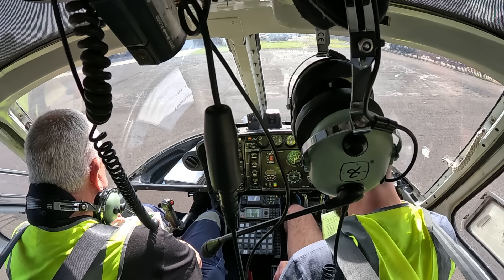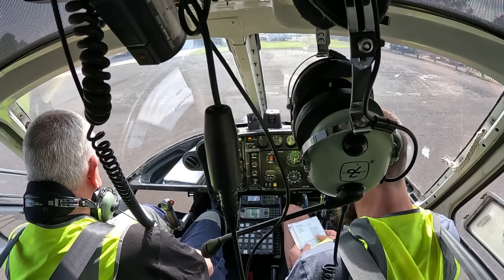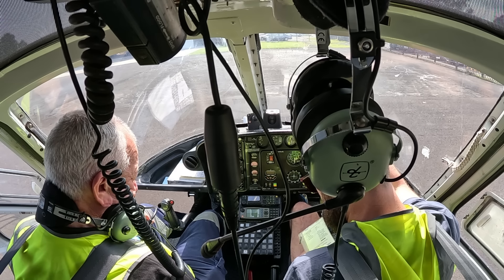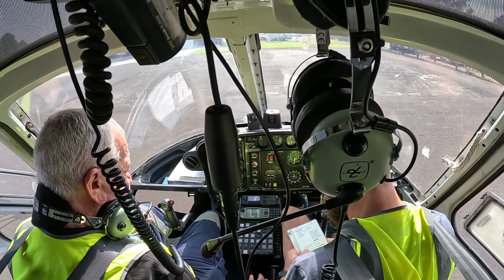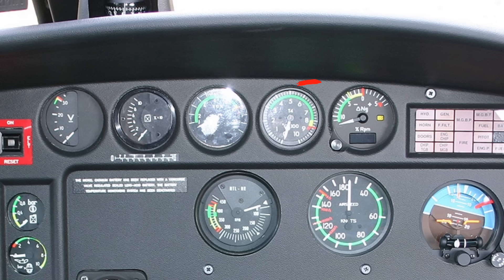So cyclic friction on. Fuel quantity — we're at 50%. Engine starting — got everything ready to go. We're about to start it. I bring that normally to that lip. Here's the starter — you can see the lip there. Hit the starter. At 10% we're going to advance it until it fires off, then you're going to monitor your temperature. It's quite a quick start.